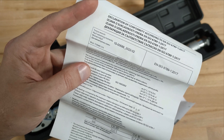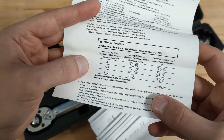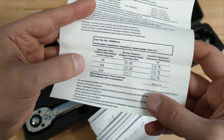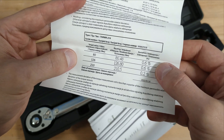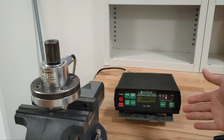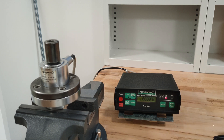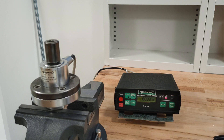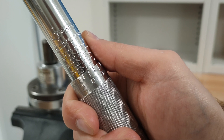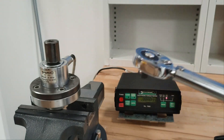There is a declaration of conformity in the package with a test certificate, and we can see that the deviation is only 0.6%. Using my professional electronic torque tester I am planning to validate the accuracy of the torque wrench. The electronic torque tester is set on first peak mode, which is designed for clicking torque wrenches. The torque wrench is set on 80 Nm — let's see what the tester will show.